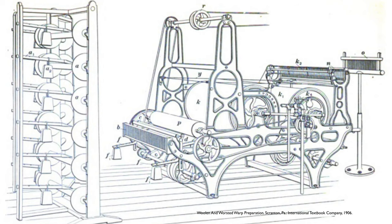Period textbooks suggest there were a lot of equipment available to help with this step of dressing. Some machines were even designed to dip the yarn in a sizing agent — a chemical designed to help keep threads from breaking — before the next steps. We haven't found any evidence yet that that step was employed here at this mill, but it's an interesting fact nonetheless.